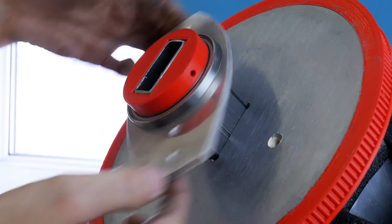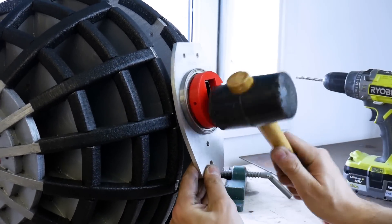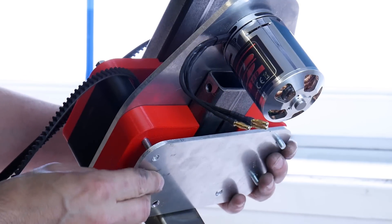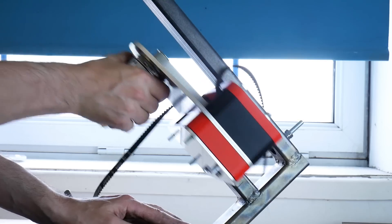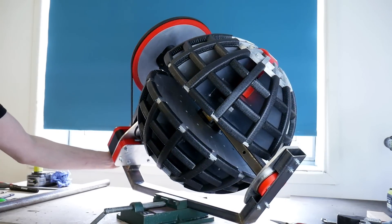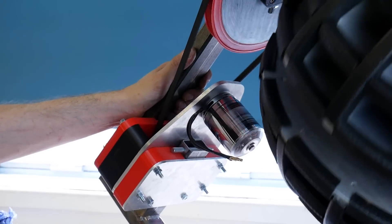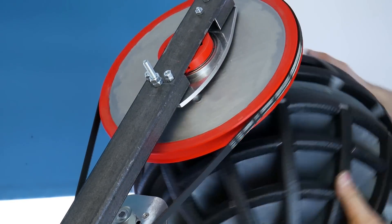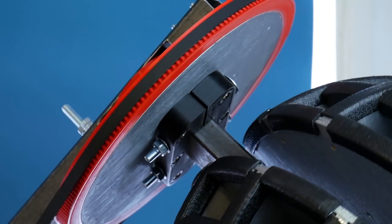With the pulleys fitted we can put the aluminium bearing plate on — there's a 3D printed stopper which fits neatly onto the square axle and allows the round bearing to run on it. One bearing on each end of the axle, though there's no pulley on the far end since we only need one pulley per axle. There was a gap in the middle of our gearbox assembly so it can slot into a piece of steel on the chassis. The whole gearbox can slide up and down so I can tension the belt nicely — we can adjust that and put a stopper and a shim in to get the belt tension perfect. An M4 bolt through the stopper on the end of the axle stops the bearing pulling off, and M8 bolts clamp the pulley square.